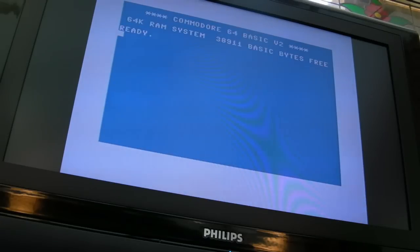So the actual original fault with this board was the kernel. That's what it was. There may have been other faults, because obviously loads of chips were removed, but the kernel was the only real thing we found. The resistor was because someone wrenched the RAM off, the traces because the CPU was removed, and then everything else has just been reinstallation, really. We went on a red herring, a wild goose chase after the RAM, but the RAM wasn't the issue. So anyway, I'm very pleased with that.